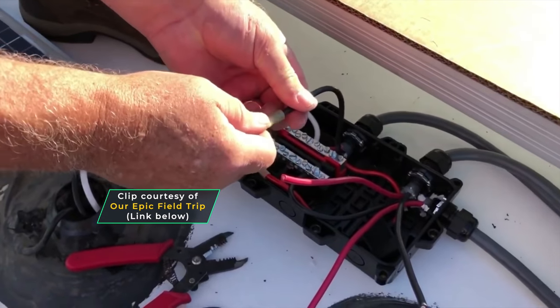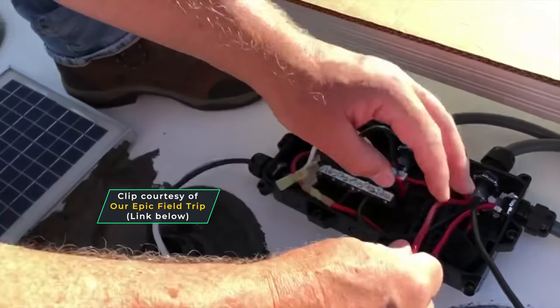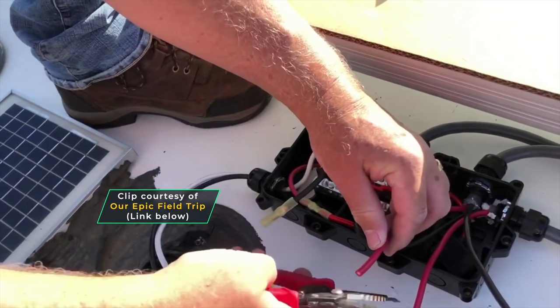Day eight was all about getting the wiring from the roof to the front bay. Now, a lot of RV solar installs, you will see a junction box on the roof where some people will put actual bus bars in there and bridge them in. Panels are in series and they wire them together in parallel in the junction box. We couldn't do that because we just have too many panels to wire all into one bundle, whether it's any combination of series parallel. We were going to end up with too much voltage or too much amperage, so we had to split it out.